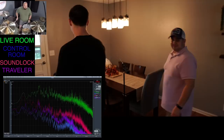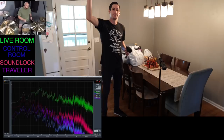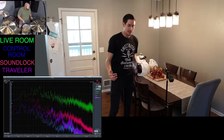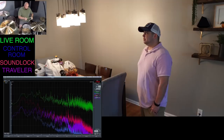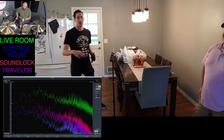Right below us is Craig. This is probably the weakest point in the whole build because with eight-foot ceilings I wasn't able to do a dropped ceiling that is acoustically isolated from the joists above — which is what you want in a room-within-a-room setup. Despite that, we're still seeing a huge difference in those dB readings. You can sit up here and live life while there's a drummer right below you. What you mostly hear is the kick and the snare; everything else is pretty well attenuated. You can feel it shaking the house because Craig is playing so hard.